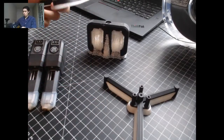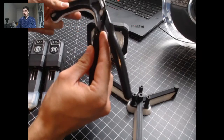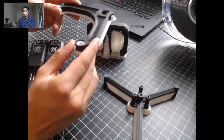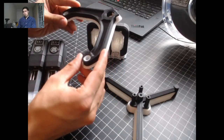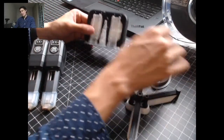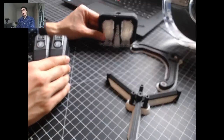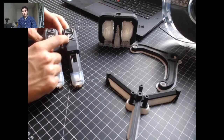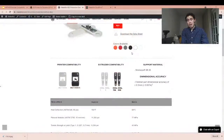And by mechanically, I mean just using pliers. We do have a set of pliers that comes with the Method post-processing kit. But yeah, it's possible to remove the support materials in some cases without having to use the soluble alternative. But it's definitely going to be much more flexible to have that soluble material, in this case SR-30, and to round things up, that works with our Extruder 2XA dedicated for SR-30, plus our 1XA, which is the one that's going to be working with ABS, right?